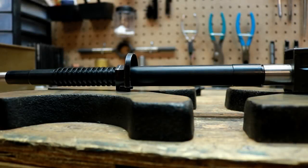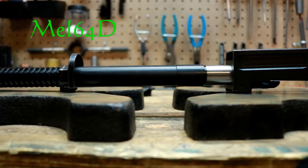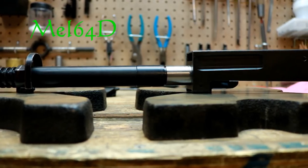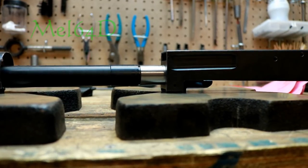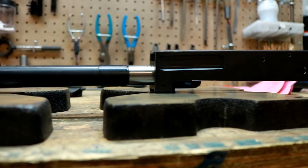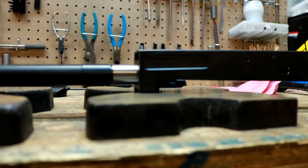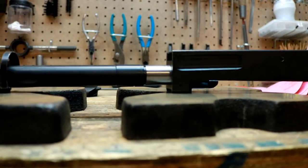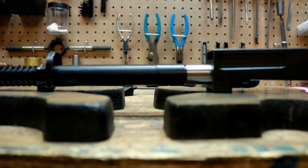Here I like to place my barrel with a lower handguard retainer on something flat, and then you can put it in your trunnion or your receiver in this case. You can either tap the end of the barrel with a dead blow hammer or a brass mallet or something. Kind of lightly tap it, and it should keep it stuck in there just enough for you to get to the press and get everything set up and press it in.